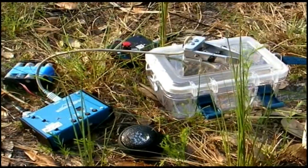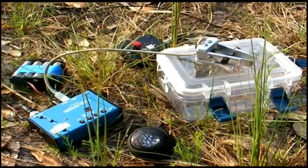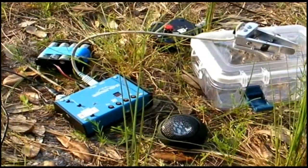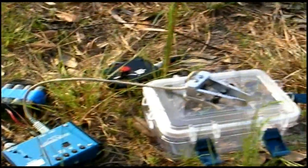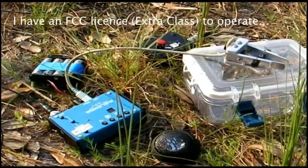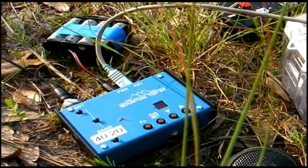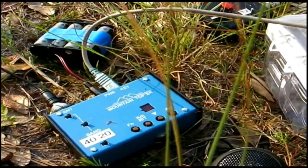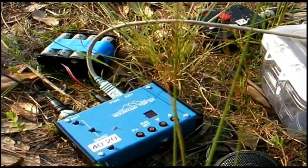Hi guys, it's been a while since I've made a video. I've been getting into ham radio — not any kind of ham radio, something called QRP, which is operating with very little power and very small radios. Here's a perfect example, it's called the Weber MTR, the mountaintop radio. The first time I used it I actually had a conversation with someone about 5,200 miles away in Estonia. It's on 20 meters — that's the wavelength or band — it also does 40 meters. It's not very powerful, only about 3.3 watts on 20 meters and 4.5 watts on 40 meters, but the range is absolutely unbelievable.